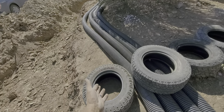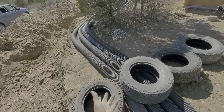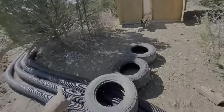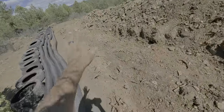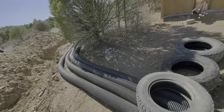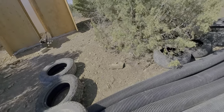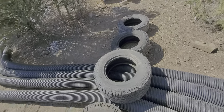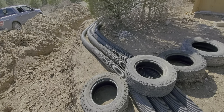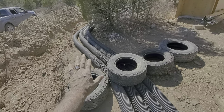I'm not going to say it's less expensive because I'm not sure exactly how much cement I'm going to need to make AirCrete to fill this — I haven't done those calculations yet. But if somebody out there wants to do it, feel free. The tubing is 100 feet long and the greenhouse will be 100 feet long. I changed my mind — it's not going to be two separate greenhouses, it's going to be one long greenhouse. So figure 100 feet of tires times four, with four inches of AirCrete — that's how we can guesstimate the material and cost for the AirCrete blanket to cover the tubing.